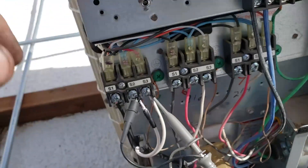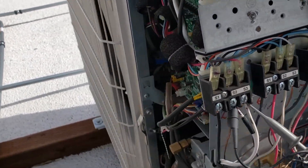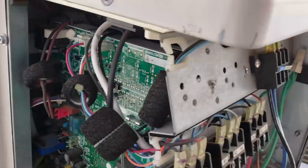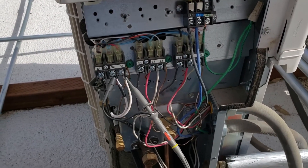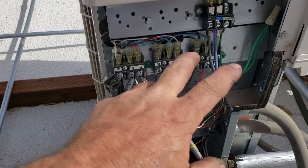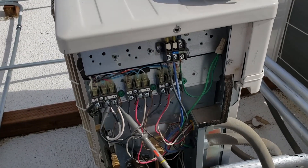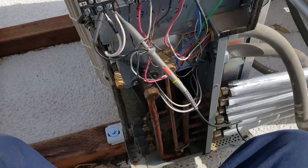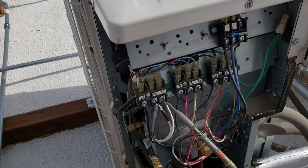Most of them do. So then the S1, S2 going down below usually has some fuses on there. But it didn't pop a board or blow a fuse or anything — it just one unit quit. And the other two units on this condenser still worked. Just one room went down below. It's got three electronic expansion valves — it's a three-port system.